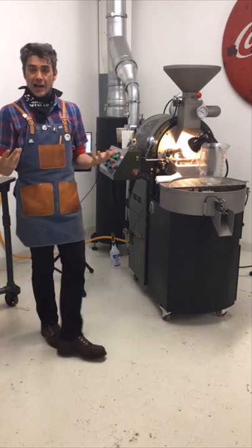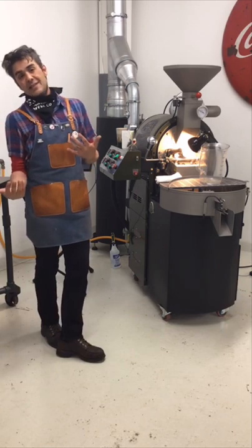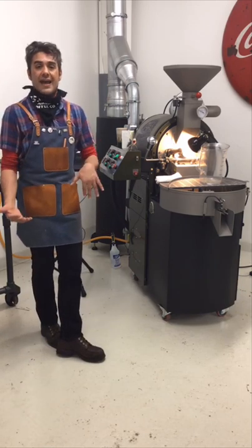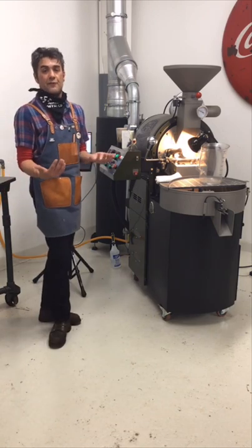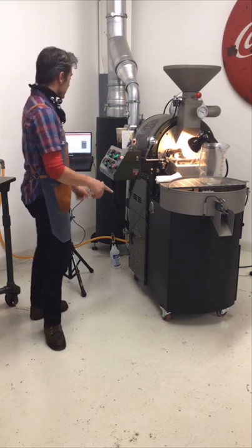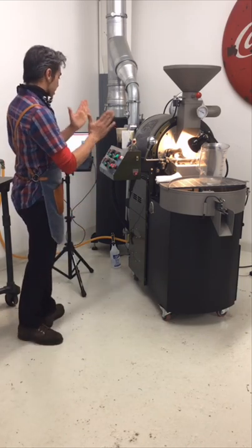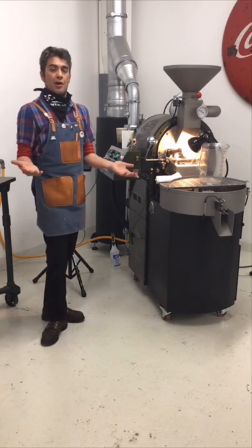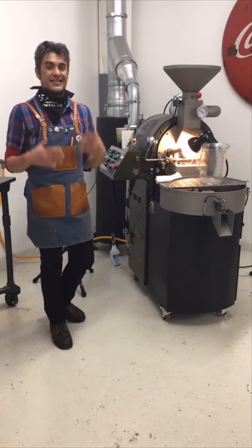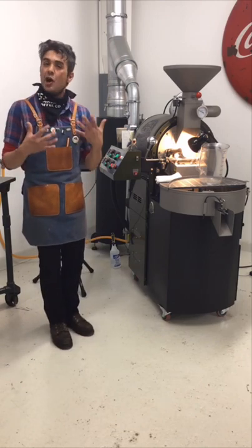I have my data logging running in the background, which I use for reference for my ET temperature and my live rate of rise. I'm running roughly 45 Hertz on the drum, which equates to 60 RPMs in real revolutions per minute of the drum.